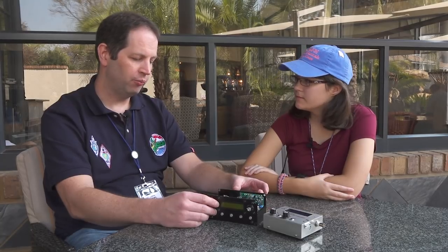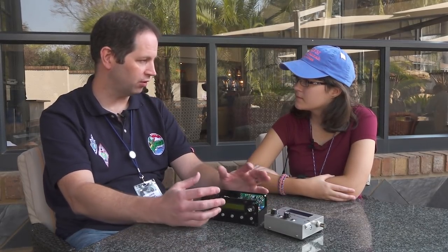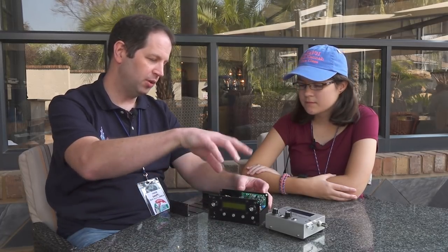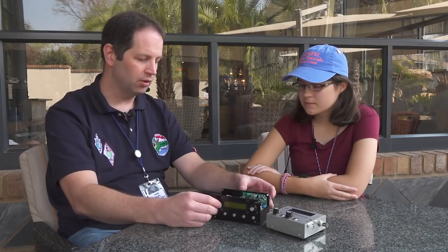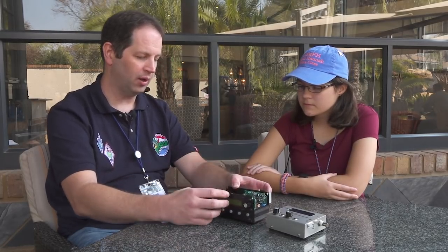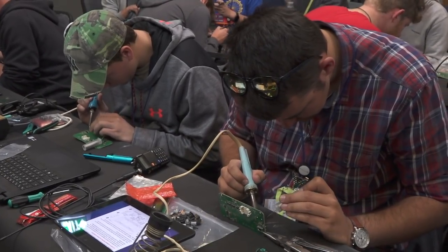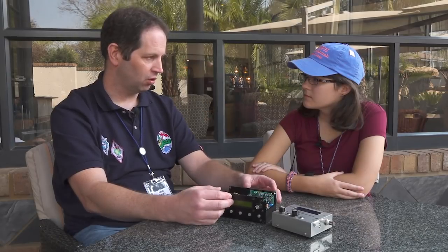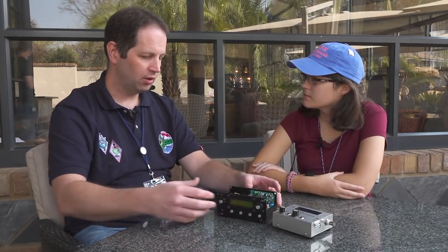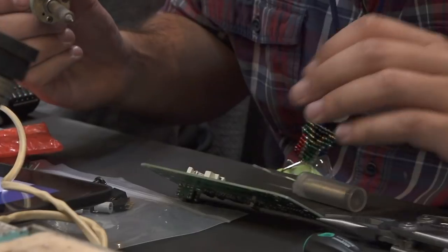So how hard is it to build? There are a lot of parts. There's no surface mount to do yourself — all the surface mount, such as the 32-bit ARM processor which is only available in surface mount, has already been pre-soldered by the factory. All the rest is through-hole components. In parts of the board it's quite dense — for example, the power amplifier area — but it has to be to keep lead lengths small for performance. Anybody can build this, but less experienced builders should take it step by step. The assembly manual is 90 pages and contains a step for every single component.